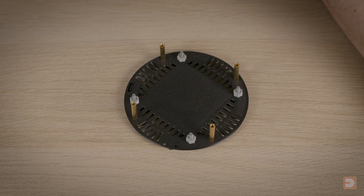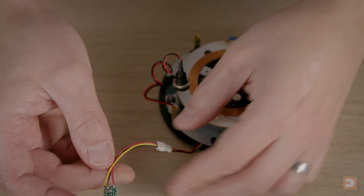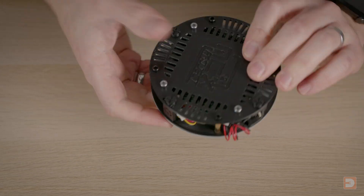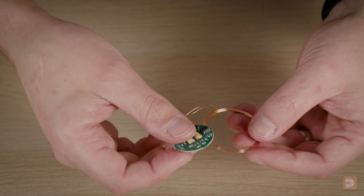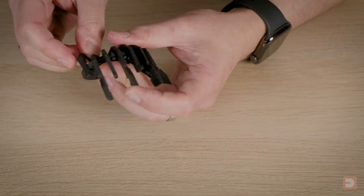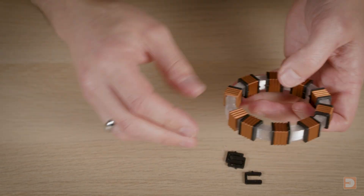Let's get the 3D printed part of this base unit popped together, along with the aforementioned nuts and bolts. The final thing we need to do with the electronics on the base unit is to plug in the touch sensor. Having applied the final touches, with the base unit all assembled, it's time to put together the levitating part of this print. With most designs you'll be able to take the whole unit and slot it straight inside the 3D print, but for this one we need to take it apart and separate some components — which gives us an opportunity to see what's inside. Here is the magnetic part, and here, as a completely separate component, the coil to receive the wireless power and to control the onboard LEDs. Let's slot these parts into the base of the levitating section of this print, and then we'll assemble the rest. This isn't a full tutorial on the assembly, but the designer has created an excellent video included in the assembly instructions on Maker World, which I'll link to in the video description.